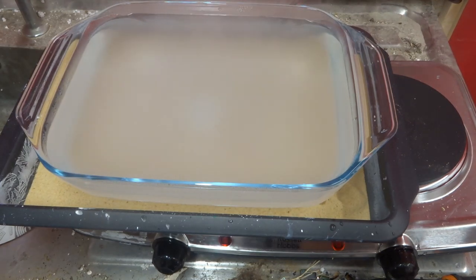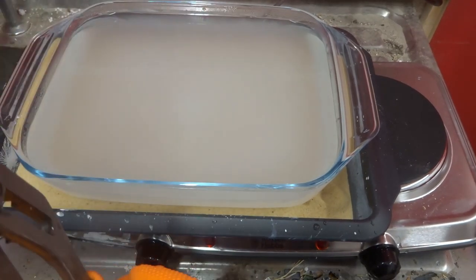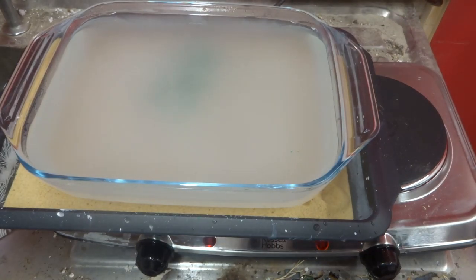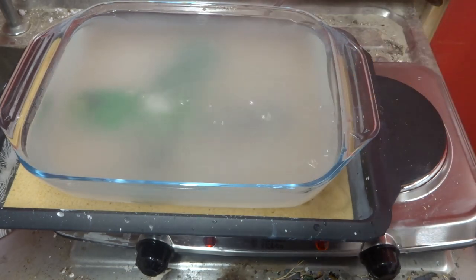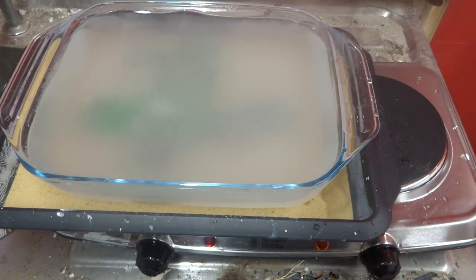I'll put on the mask now and pause the video, then come back once the mask is on. The next step is I take the mobile phone boards and just submerge them in the caustic soda solution. I throw a few in and leave them in there for a while. We'll pause the video and come back once the solution has softened the solder mask, and I'll add more caustic soda if needed.